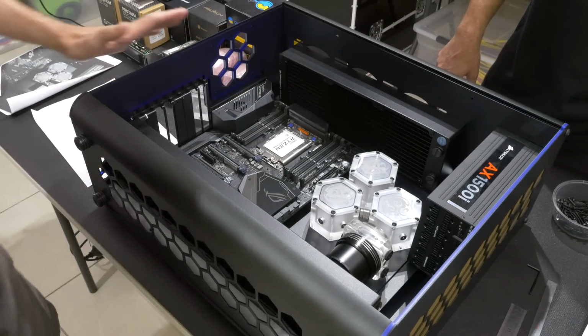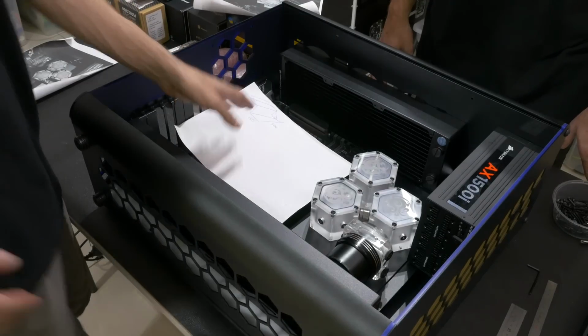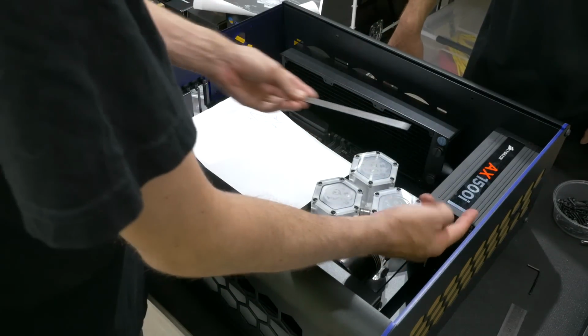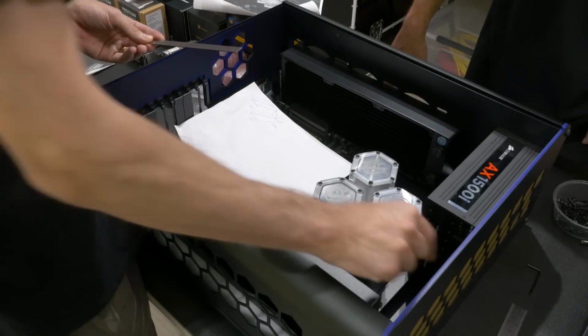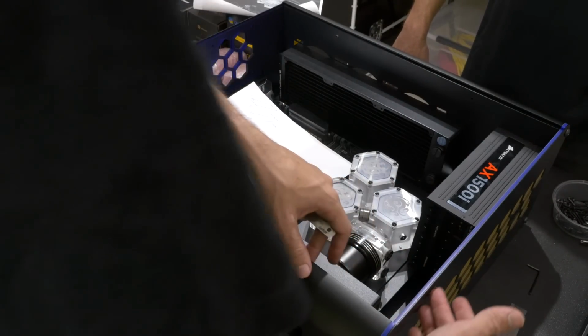The customer planned this out really well. You can see his mock-up here. We've roughly drawn it up here, but we need to get more accurate measurements. So we're going to have a 15mm bent section up here to connect to the acrylic. We're going to use countersunk screws on there so that the acrylic can still meet up against this panel, and so that there are no mounting holes or screws visible on this front panel. We don't want that.